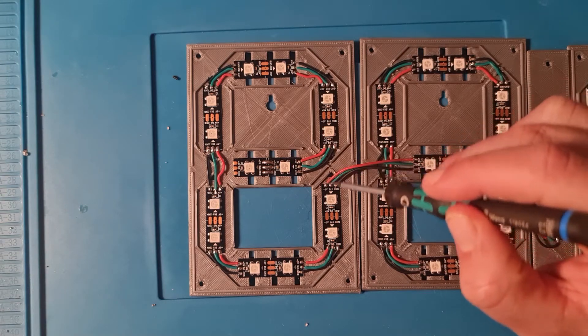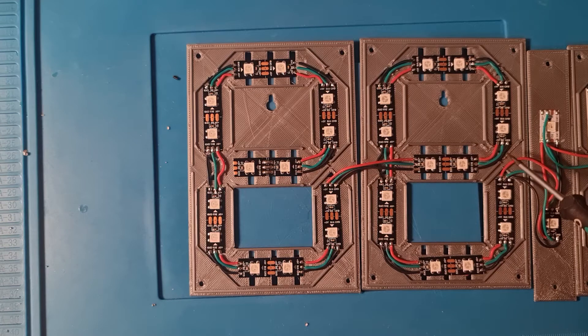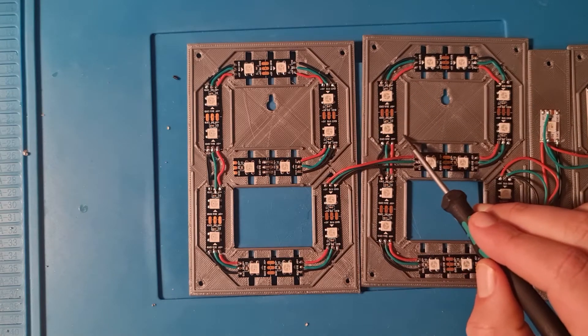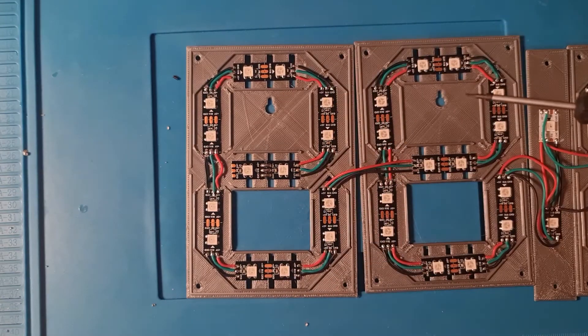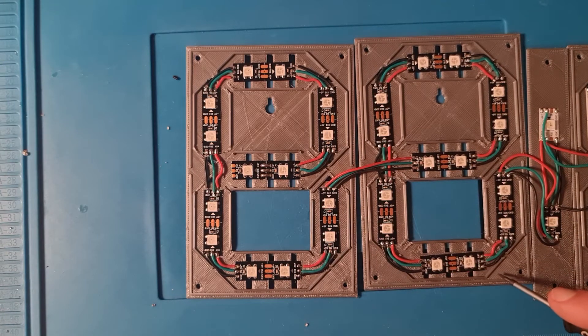You can see the wires come in from the other side, go down, go up, and come across and then to the next seven-segment display. You need to make sure your wires are quite neatly soldered because you're going to put something over it. You cannot have the wires outside of these extrusions because you want to make sure the light doesn't escape to the next side of the segment — when a light goes on, all the light should stay in its own little bubble. Normal convention: black for ground, red for power, and then choose a color for the signal.